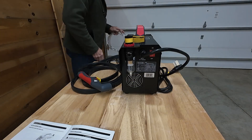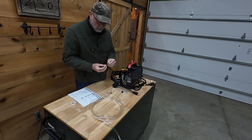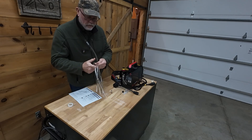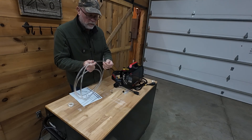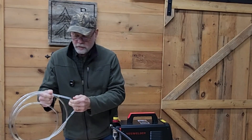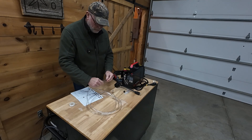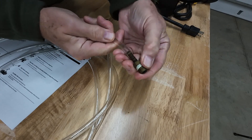Now I'm going to go look in my stash of air fittings. I think I've got a barb over there. I scrounged around and found a barb that looks like it's going to fit — it's a quarter inch. What size does it actually say? Ten by six and a half millimeter, so six and a half is basically quarter inch inside diameter — six point three five millimeters would be a quarter inch, but six and a half is close enough, so this quarter inch barb will work. I just don't like having hose clamps hanging out; I'm always catching a finger on them. But I guess that's what I need to do.